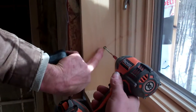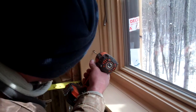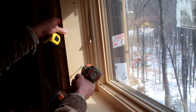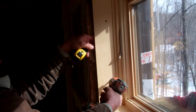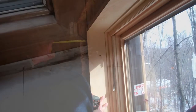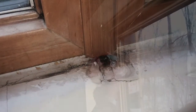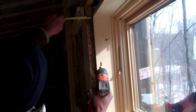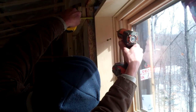When you're shimming windows, out of habit builders often screw through the shims and leave them in there. But if you screw just above or below your shim, you can pull them out because they're not needed. If you leave the shims in there, they're going to act as a thermal bridge — first of all, it's wood, not insulation, and it can lead to condensation. Also, shims are usually wet when you buy and install them, and they're going to dry and shrink, leaving an air gap for air leakage. So if you can, get the shims out — they serve no purpose once the window is fastened.